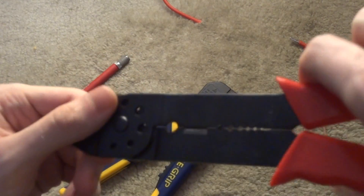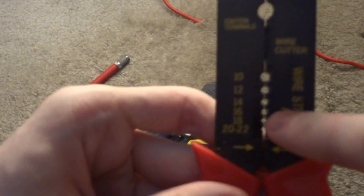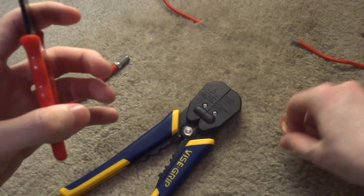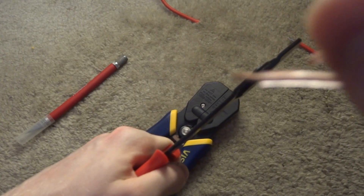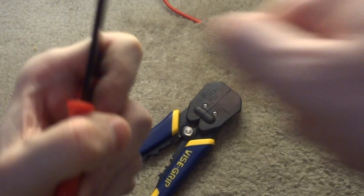This is your most common stripper, found in a lot of crimp connector sets if you're doing wire crimping. This one has preset holes already cut into it for different sized wire, all the way from 10 gauge down to 20 and 22 gauge. With our 18 gauge speaker wire, I find the 18 gauge hole, put it in there, and strip it off. That one stripped the wire a lot better because it's already got a hole cut for that size wire, though I still had to do some manual labor pulling on the wire to get it to strip.